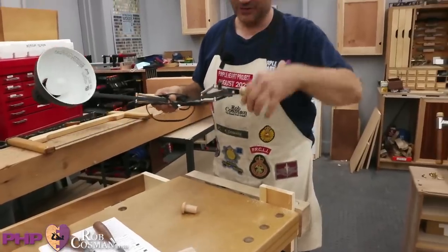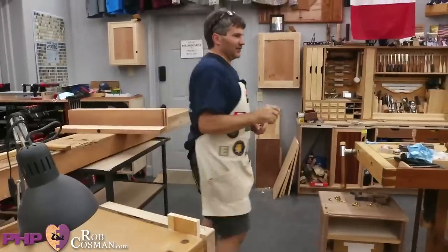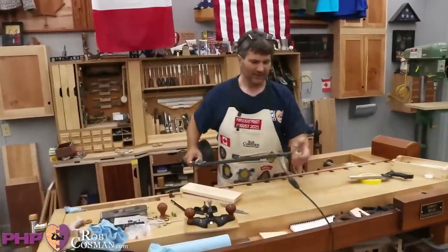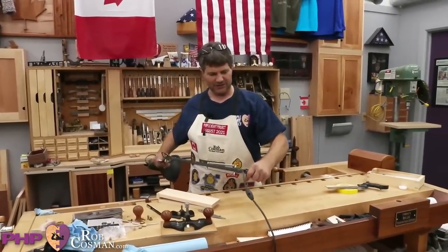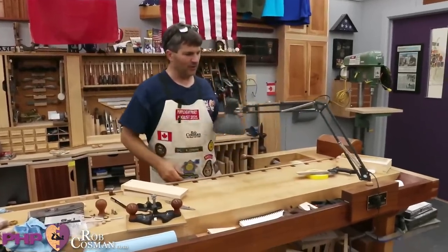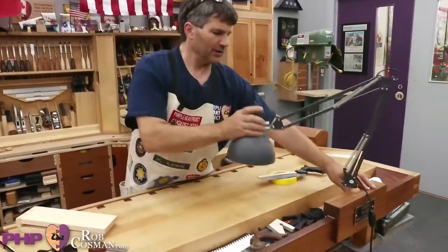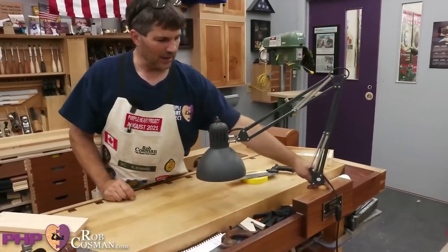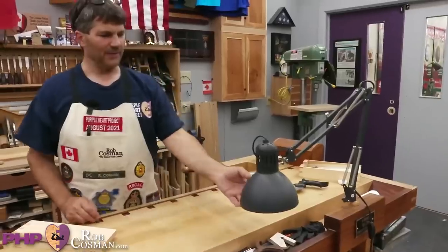Well, we will do it for yours. We put a steel rod up in there and then another nut and bolt to cinch it down, and that bypasses that weak link. And then we turn this little wooden mushroom so that it fits in there snugly enough that when it's in that one-inch diameter hole, instead of this turning inside the half-inch hole, the big mushroom turns in the one-inch hole, and it lasts much longer.